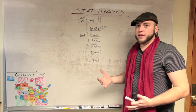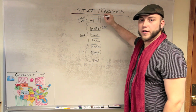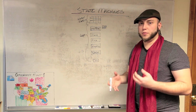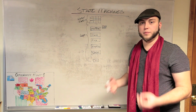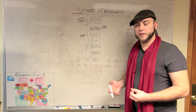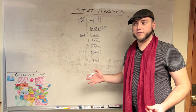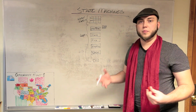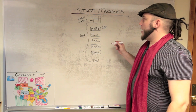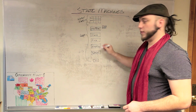This is a really sort of abstract view of what the sketch is doing that's running on my project. The way that I have this set up is I have, at the very top of the sketch, a whole bunch of global variables that I've set up. Generally, you want to stay away from global variables when you're programming things, say, for a computer. On a microcontroller, it's not so big a deal because you're not going to run into as many conflicts. The microcontroller doesn't have the spare room to be running a whole bunch of stuff, so you don't have security problems. The way that I use my global variables in this program is basically as a whole bunch of mailboxes that allow all of these little pieces of code to talk to each other.